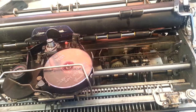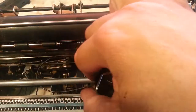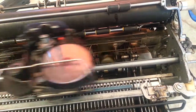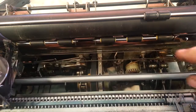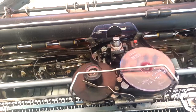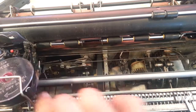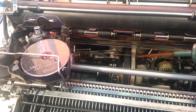Tab over — okay. Tab over — okay. It's a little tight. Let's clear all the tabs. Tab over, return back, tab over. It's a little... no, it's just dirty. The machine is just very dirty. I've got it far enough now that I can determine if this is going to be a salvageable machine. Very dirty. It's got some noises and a little bit of noise coming off the operational shaft here. Let's put some Lubrilon down here and see — that helped a little.